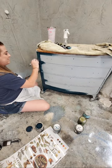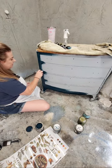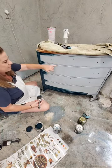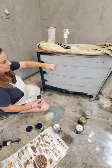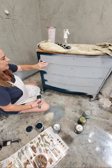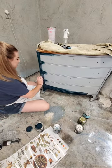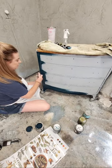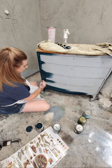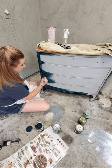I have a trim mold that I made a long time ago, and I'm going to need to cast that in some resin. What I mean is I have a basic half round that I copied ages ago, and I kept the mold. So I can make a copy of that using that existing mold that I have. And that's a pretty cool thing. Some molds you see are really common, and this is one of them. So I just make a copy of it, and then you just hang on to that, never get rid of it, and you'll use it over and over and over again.